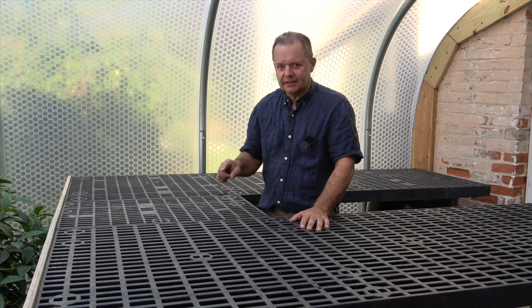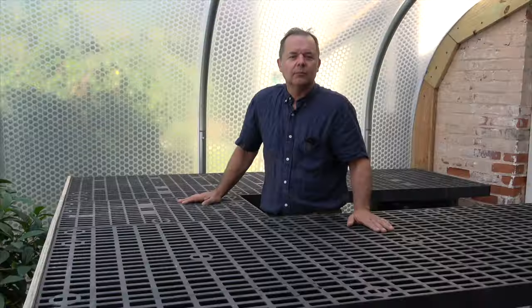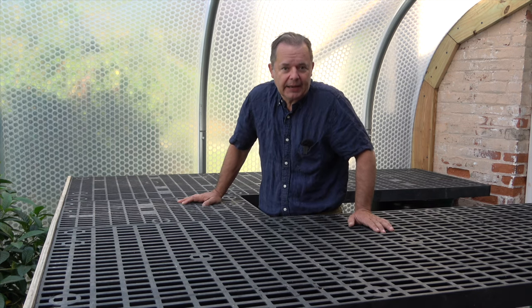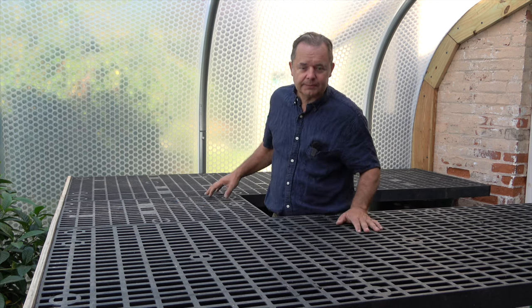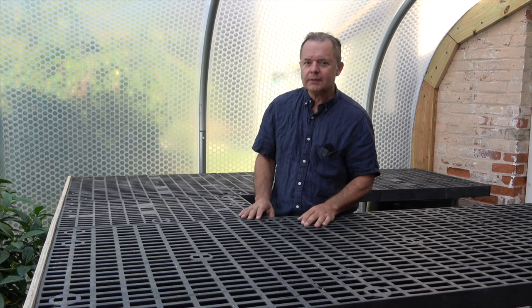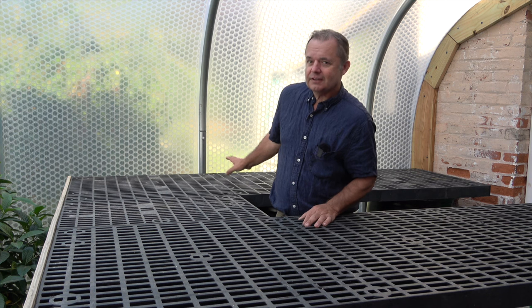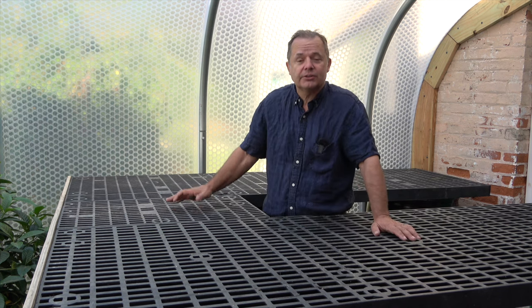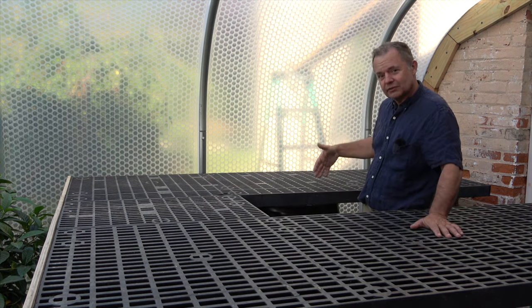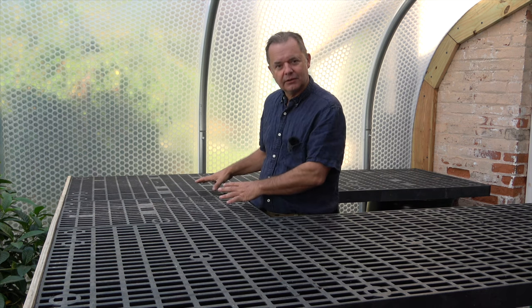Now let's talk about heating. Behind me I've got these beautiful black plastic barrels and they're going to get filled with water. What they do is act as a battery. All you have to do is spray them black, site them in your greenhouse, and they do a number of things. They take in any direct energy from the sun that can come through the greenhouse, and that heat will go into the water stored inside. In my environment, they will act as a battery and store energy to be released at night. So let's say they get to 50 degrees Fahrenheit during any given day — the temperature outside drops, but I've now got three huge barrels staying at 50 degrees. They're not going to suddenly go down to freezing because there's so much energy stored in them. So that will form the backbone of the heating in my greenhouse, my secondary greenhouse.